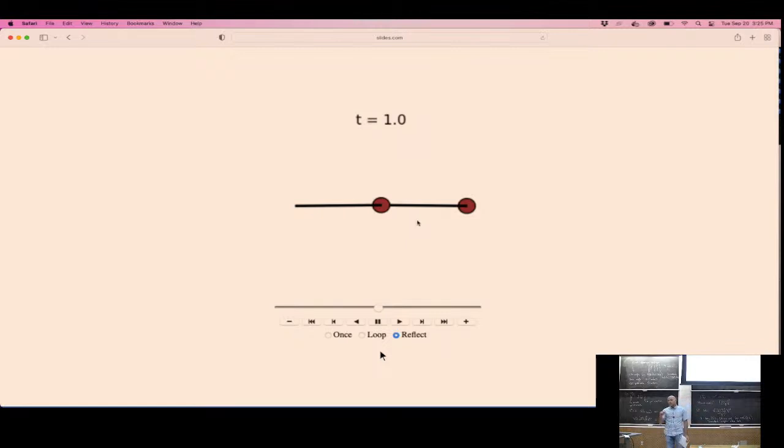Yeah. So typically nowadays, the controllers, that big box underneath the robot, says you've asked for a big velocity, and it turns off. If you made your own robot and you didn't put that safety protection in, then I did throw a robot across the room once. Yeah, that can happen, right? And there's big red buttons next to the big robots in case that starts to happen. Yeah, but it can really. That math is bad. You shouldn't apply that joint velocity command. Okay.